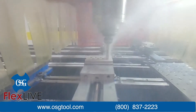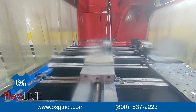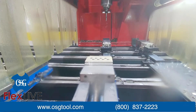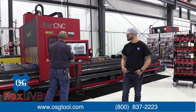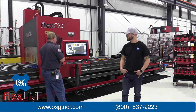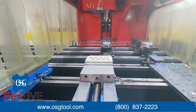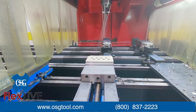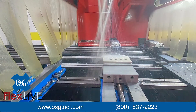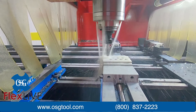Look at that SUS drill just tearing it up — that's impressive. Just to speak on the feeds and speeds of the last drill we ran: that drill was running at 2,000 RPM at 50 inches per minute. The taps were running at 100 surface footage, which puts us at 509 RPM at 50.9 inches per minute on the tap. We're flying! Those are exactly the typical metrics you'd want to see on aluminum. And this looks like round two with the A-TAP — it tackled that steel well, so it should do just as well, if not more, in aluminum.